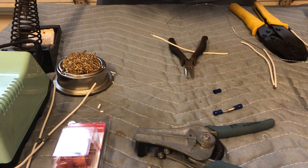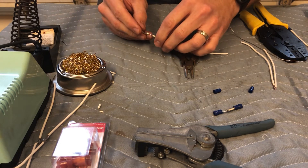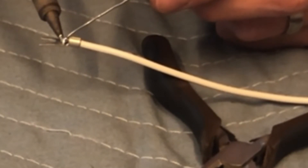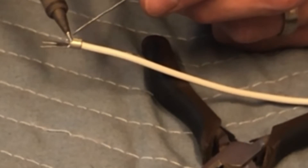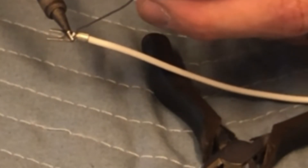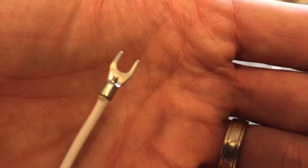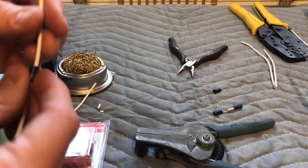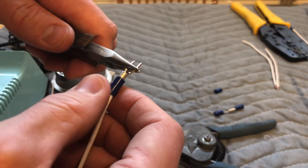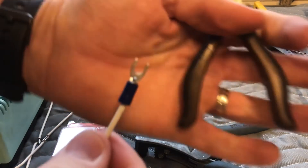You can always take the jacket and just twist it off. If you want, you can also solder these crimp connectors. Just wet the end the same way — you'll see it wanting to wet onto the material and run once it starts flowing. The good news is if you have an exposed end like this you can put the jacket back on there — just push it back on. Then it looks real nice and pretty.